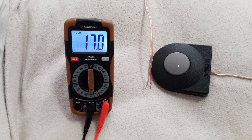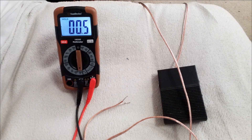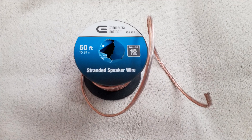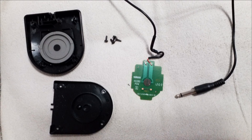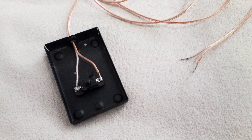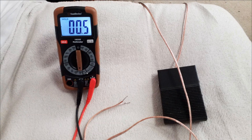The other one reassembled reads only 0.5 ohms — half an ohm — which is actually within the error range of my meter. Some of this resistance is just from my probes, since these are custom probes. The difference, I think, is the fact that the membrane one has conductive material pressing through a membrane, and that's where the resistance comes from, whereas this one is just a straight button — metal to metal to metal. That's why I'm getting such low resistance.